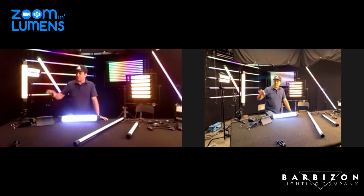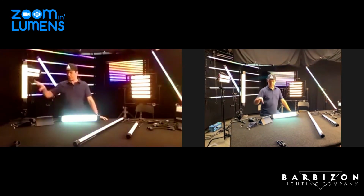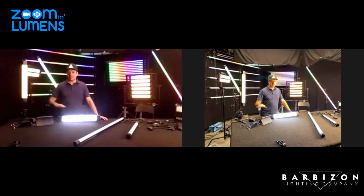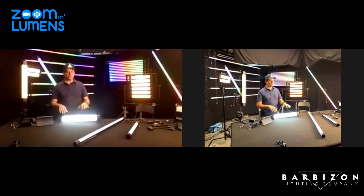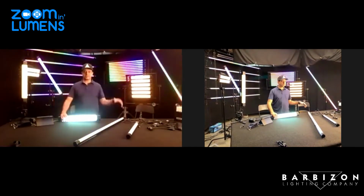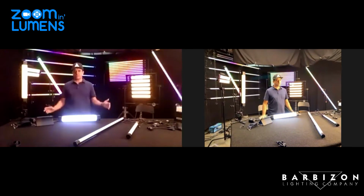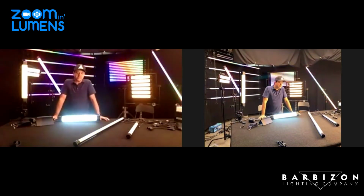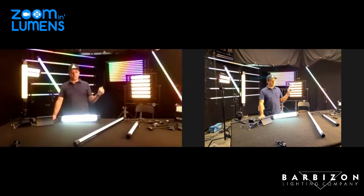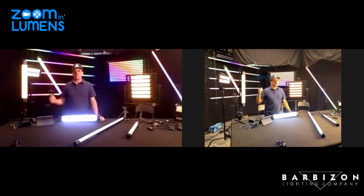Going back to Bluetooth control here, we're connecting directly to the lamp. There's no intermediate device. It's just the iPad directly to the light. Nice and simple that way. When you do connect through wireless DMX, you could pair it with a transmitter, just the same way you would with any other wireless DMX light by Lumen Radio with CRMX. So with CRMX, you can also go in wireless, and eventually you'll be able to come out wired.